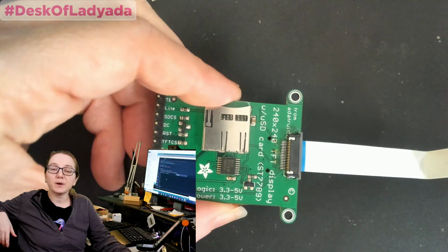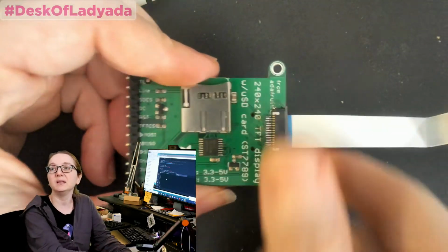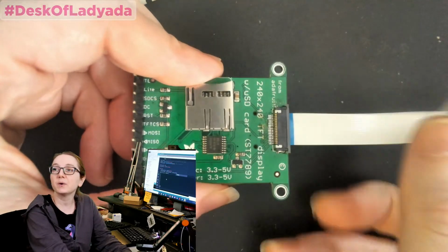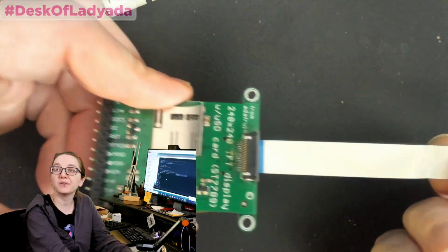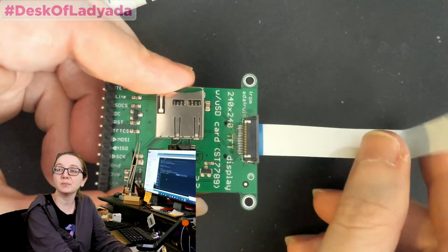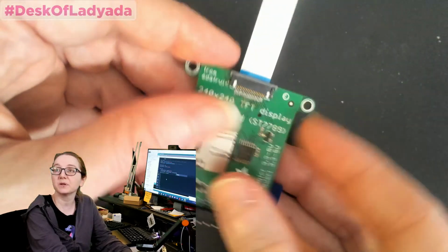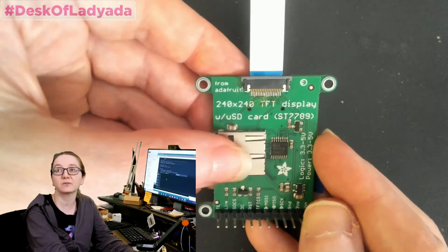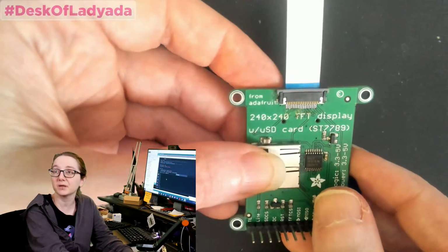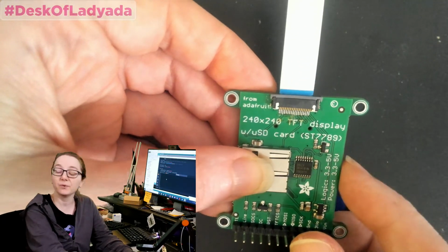And I kind of thought about it. Well, there's so many pins. A Pico blade cable would start getting a little spaghetti. And then we noticed that DFRobot was using these flex cables on their displays. These are 18-pin FPC cables. They're nice and slim, and they have plenty of pins. So we're going to start adding them to our displays too. We're going to use the same pinout because they did a good job. So I'm just going to do what they did and make it compatible, rather than trying to come up with my own thing.